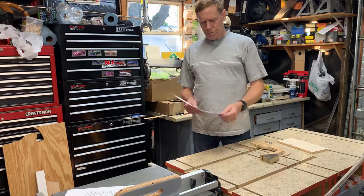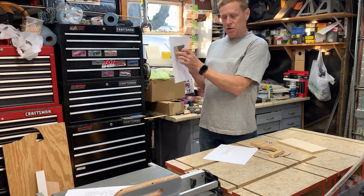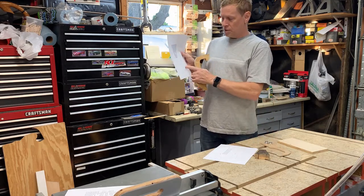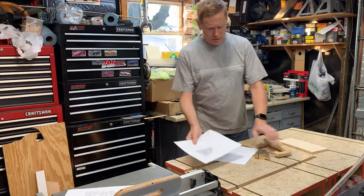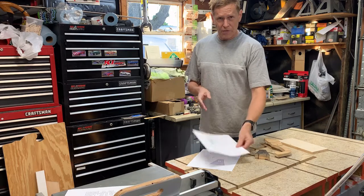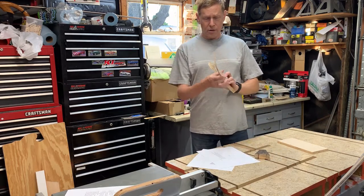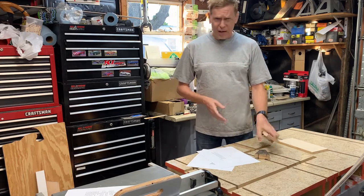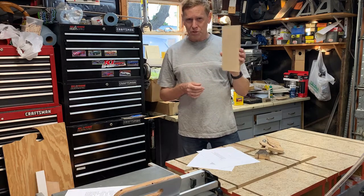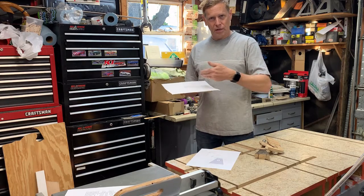In the PDF in the description, there are two templates. The first is that block that we're going to attach to the lid, along with a couple of drill points — the pivot for the arm and the stop where the screw goes. The second template is the design of the arm. I've done the arm a couple of different ways in my prototyping: in three-quarter plywood, in quarter-inch plywood. I really think half-inch might be just the ticket. So I have a piece of scrap half-inch plywood that's just the right size. We'll get the template cut out, adhered to the plywood, and get that cut out.